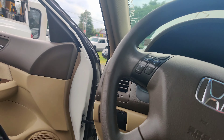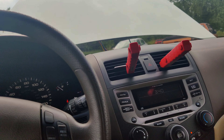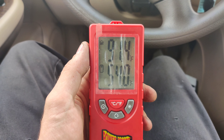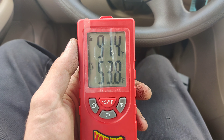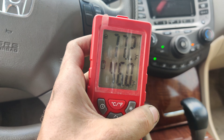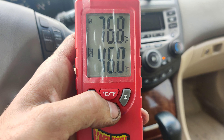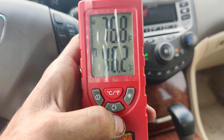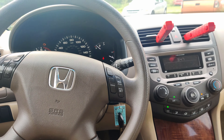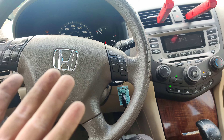Let's see what happens if we put the windows up — let's see if it'll drop. Oh man, this thing's ice cold. Look at that drop. Let's let this sit and see what it is. Look at this guys — 46 degrees coming out of the duct. Yeah, 46 on both of them. It's been sitting here for like 15 minutes or so. Confirmed fix, guys — temperature's staying down. Hope you guys like it. All it needed was a radiator fan and three relays.